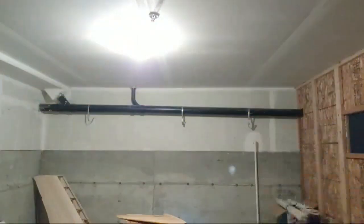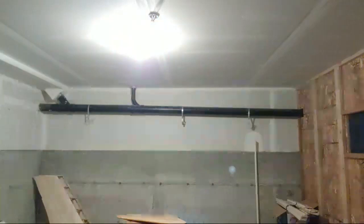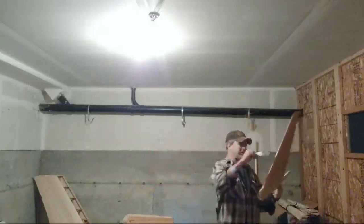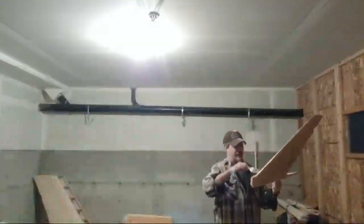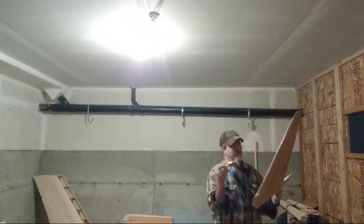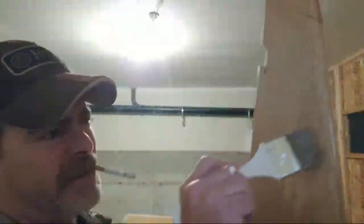Basically what I'm doing here is I'm looking for the brush I just used, and I'll simply come back and tip these out. And that's why I wasn't too worried about them. If you look in here, anywhere these are just run, it will run over a little bit, and it's okay once you do this just to kind of tip them out. If you don't know how to tip, it's no big deal.